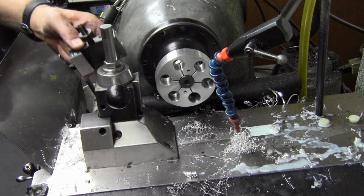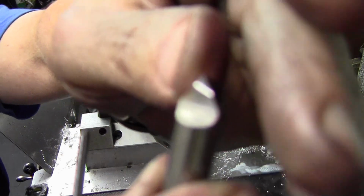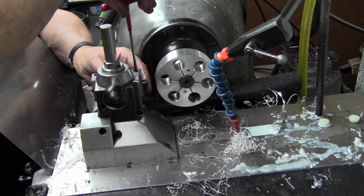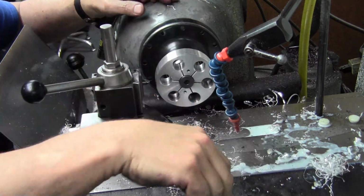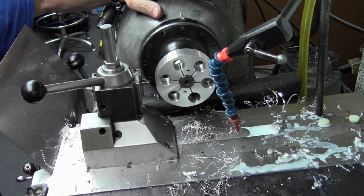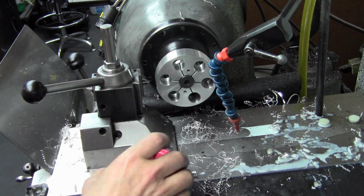Now I'm going to put a tool in sideways, and I'm going to use the lathe as an actual slotting shaper. There's the tool there. Just a little V groove tool, a positive rake, but that's putting in there sideways, and I'm actually going to use this as a shaper and put the grooves in axially. Just tightening the tool in there. Remember where the tool's cutting sideways, I'm going to be moving the carriage back and forth.